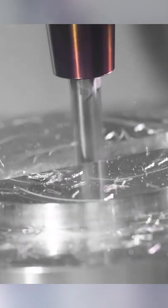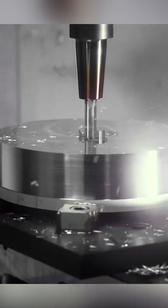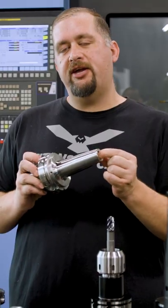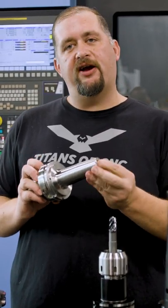Because of the availability of the slim body chucks, you may notice Jesse using these quite a bit over on our DVF 5000. Shrink fit holders are going to give you good accuracy and good concentricity with very little runout.